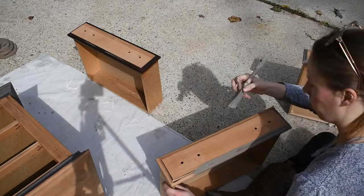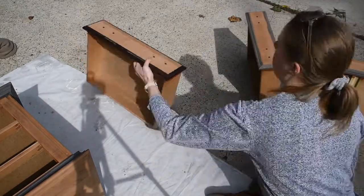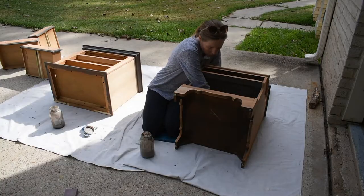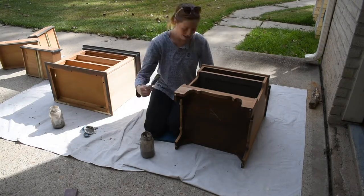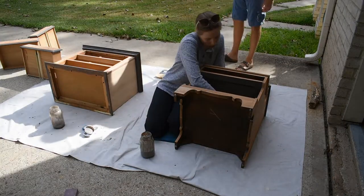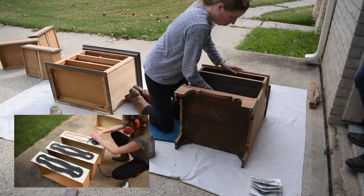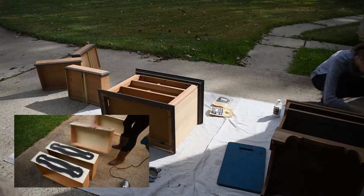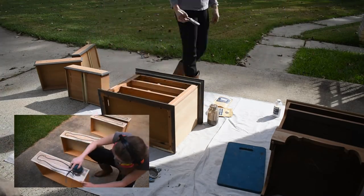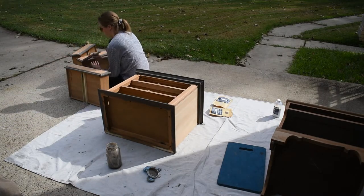I'm going to take my time to stir this stuff up really, really well, then let it sit for at least 10 minutes before I use it. Milk paint comes in a powder that you mix 50-50 with water, and I'm going to give it an extra boost with a bonding agent, again mixed in 50-50 proportions with the pre-prepared milk paint — this will give good adhesion on the sanded trim. If you've seen any of my videos using milk paint before, you'll know you want to mix up enough for all coats you want to do, and you only have about 24-48 hours to use it. This is especially important because I'm making a custom color — I really cannot come back and make any more, so I'm going to make a lot. Now it's time to get started with painting. I decided to use a slightly messy method, over-painting the lines and then coming back with a sander to buff out anything that wasn't on the right surface.